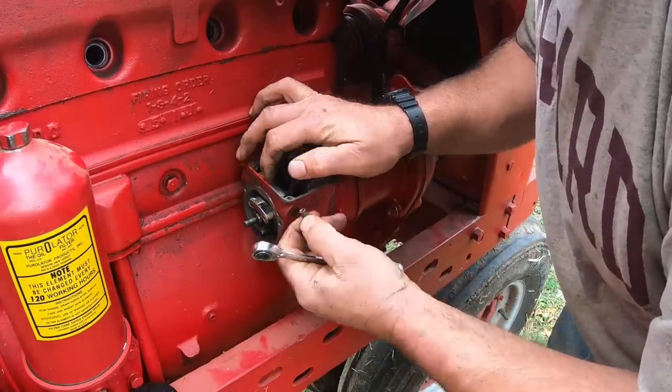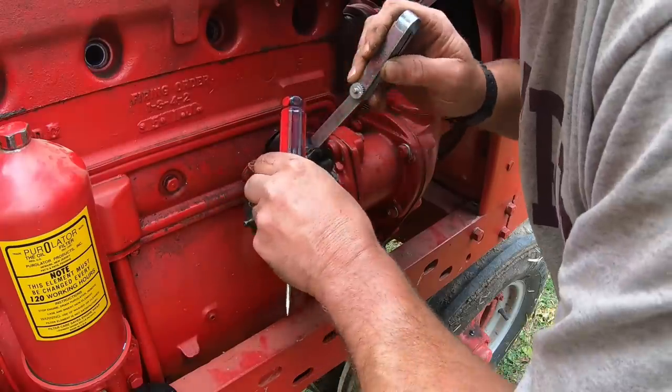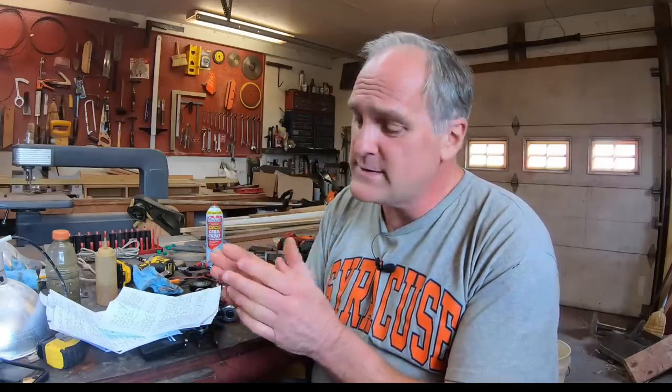Now it's time to open up the magneto and take a look at the coil and the condenser. One of them going bad would cause the tractor to suddenly die, as it did, so I suspect one of them is the culprit. The coil and the condenser have pretty simple jobs in the magneto, or in a battery ignition system, or a common distributor system. The coil steps up the voltage — you want really high voltage so that it will arc across the electrode at the end of the spark plug. What the condenser does is, as the points start to open inside the ignition unit, it keeps the points from arcing too much. It collapses the electric field quickly, because if you get a lot of arcing across the points, it's going to wear the points — they'll pit from all that electrical energy.